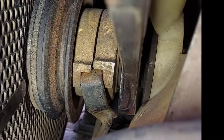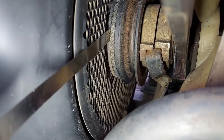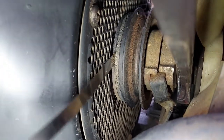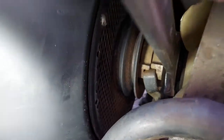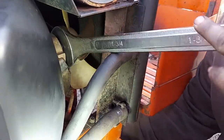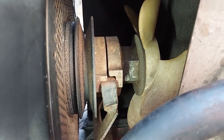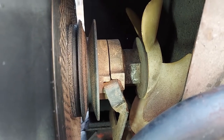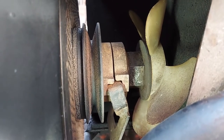Stick a feeler gauge in there — that's where your gap is. Right now we're using an eight-thousandth gauge. We go a little bigger than the book specs because when you tighten that front nut it always seems to tighten up a little bit more. It still slides in pretty easily, so we're going to go a little more on the big nut. After cycling it again, the handle is going a little harder — it might be a touch tight. Check the feeler gauges; you still get the distinct clicks — one, two.